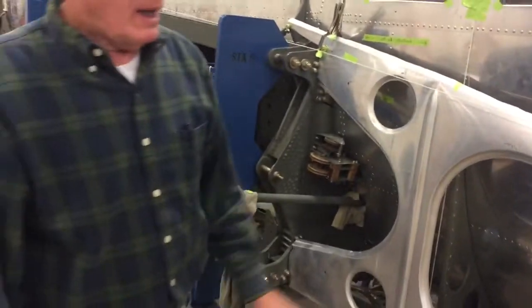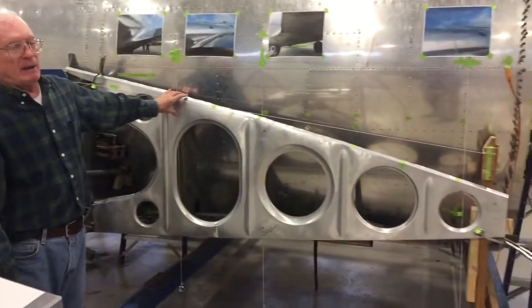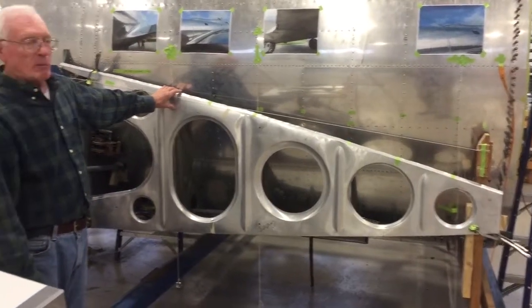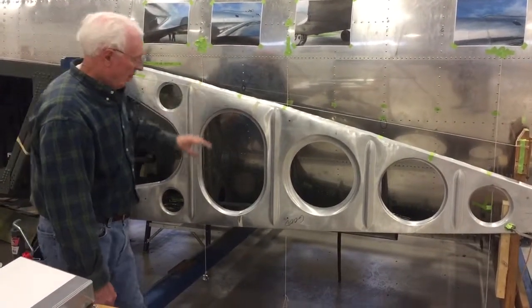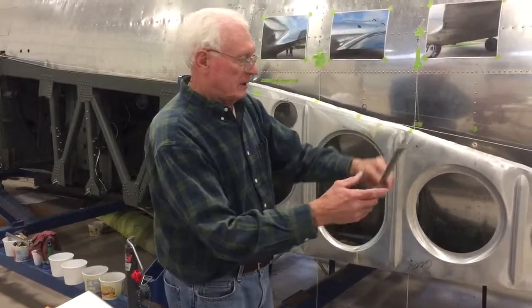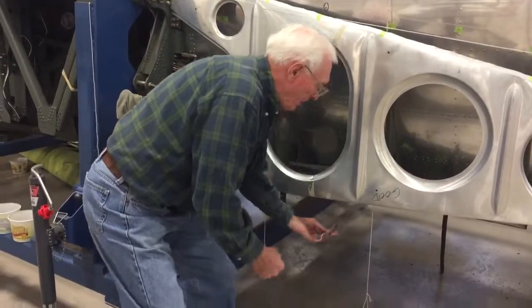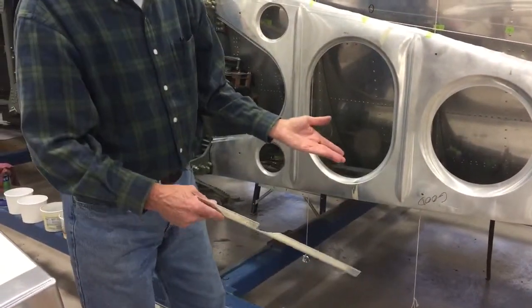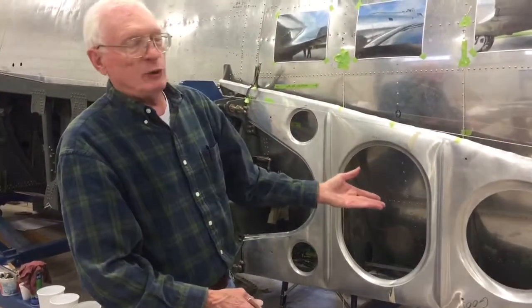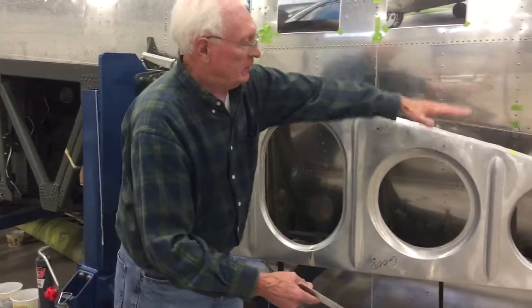That airplane was here a couple of months ago. I have one on the left hand side of the airplane and one on the right hand side. This will take me a while to finish because I have to make all kinds of brackets — like this — that have to go underneath, get secured, and riveted in place. Then skin, which is an aluminum 0.042-inch thick material, covers all of this up so it's boxed in.